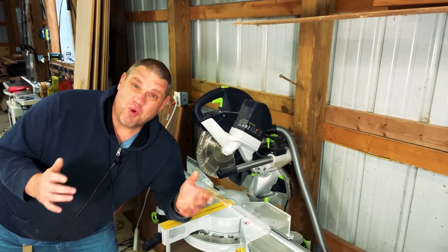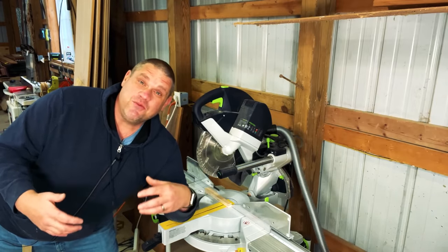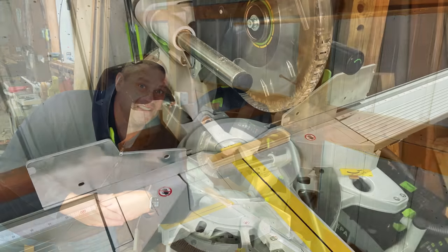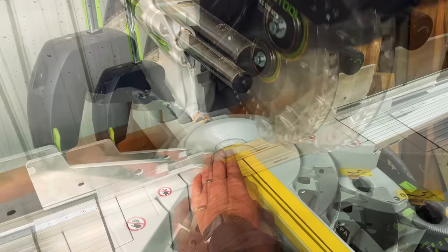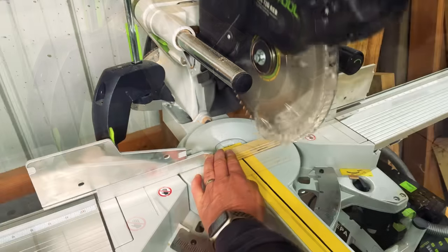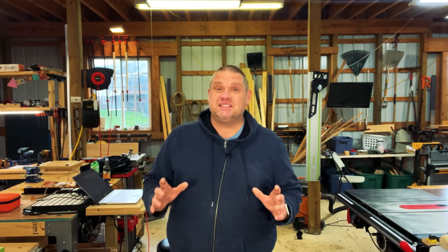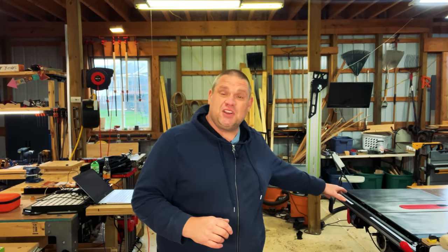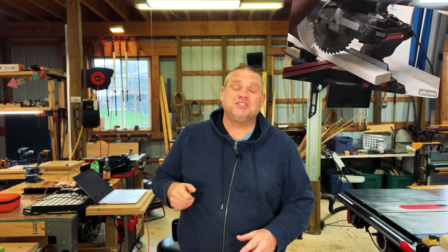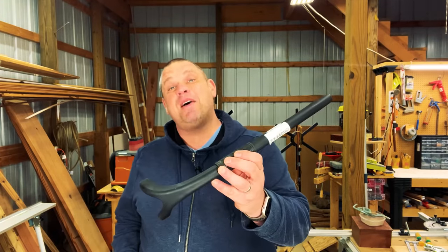One of the best things I learned from watching Steve Ramsey is you always need to think through your cuts — think of where the blade's going to be when you make your entire cut. If there's ever a cut that you think might be just a little bit sketchy, you should absolutely not do that cut. This feeling occurs at the miter saw more than any other saw in my shop, because instead of your blade being stationary like at the table saw, your miter saw blade is actually moving.